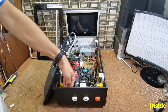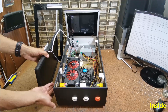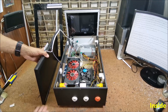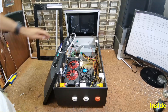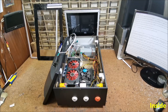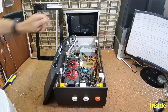Here I have a small mechanical tilt switch that is also connected to the controller to perform this function. I also connected a small button in parallel with the tilt switch, which is located close to the flipper button, so it can also tilt the board mechanically. The sound is obtained through this small Class-D audio amplifier connected to a 3W speaker, and the potentiometer serves for volume regulation.